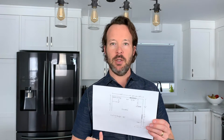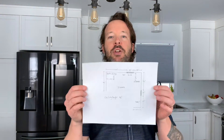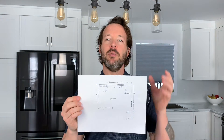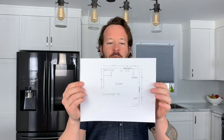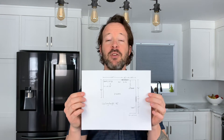It's important to keep your measurements to the outside of your drawing so everything is consistent, and all the notes or other information — such as appliance locations or if you want an island — can go inside the drawing. It is also important to indicate the ceiling height of your room, so make that one of the last measurements you take. When all is said and done, you should end up with a drawing that looks something like this — it doesn't have to be perfect, as long as you have pretty accurate measurements and a clear indication of what your kitchen looks like with just the walls.